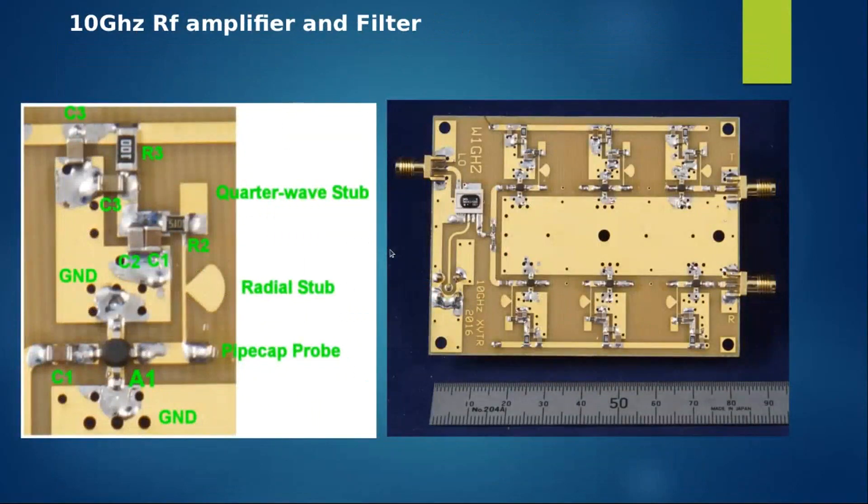Here's another example of what's really needed for the RF stage - that's the actual device with the power injector. From a principle point of view it's really simple to build. If you use that 0.3 mm track width, that gives you 50 ohm impedance for ER 4.6 normal PC boards - not the expensive PC boards normally used for 10 GHz work.